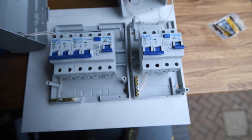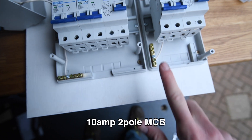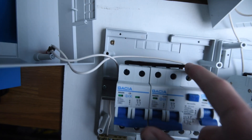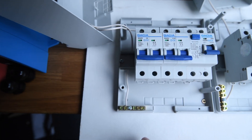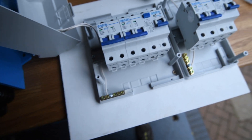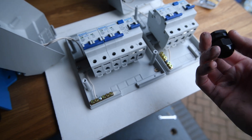Making up my little consumer board. We're going to have the AC coming in from the shore power going in there — it's already got the metal bars coming pre-installed at the top. Out there into the inverter. And then the inverter is going to come out, go into here which is the second RCD — it's already got the bars on the top which join them out, so it comes out the bottom. Then these will split and go into my circuits — probably one on the passenger side and the more powerful one for the kitchen side. To keep it all nice and snug I'm going to drill some holes in the bottom of the casing and just use glands so I can put them all together and it nicely secures the wires in place.